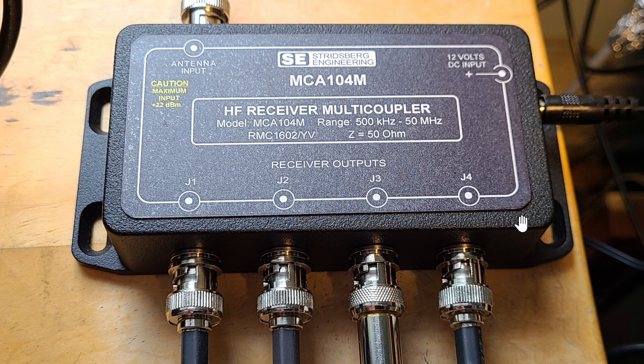But there are times when you need a little more. What you mostly want is that the outputs are isolated from each other — that's the key feature. If you're looking for any type of antenna splitter for multiple radios on the same antenna, the main factor is that each port is isolated. That ensures there's no interaction between radios. When I've tested different receivers — Tecsun, Sangean and others — I did notice that with some radios you can just split with no difference, but with others plugging them in causes less reception on one side, meaning there's interaction happening.